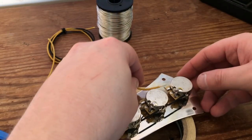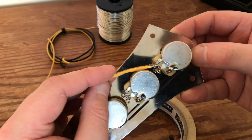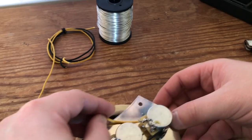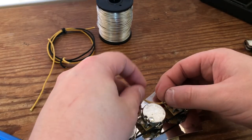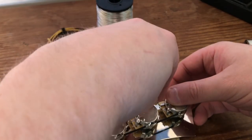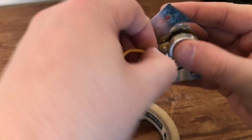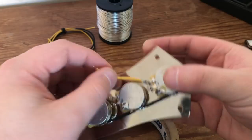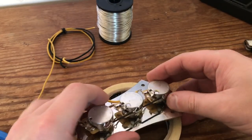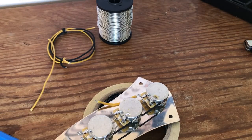So that's why you'll see a lot of people, and myself included, I do it from time to time anyway. They'll have the wire into the terminal like that, and then they'll solder it in place, which is fine. It's very good if you plan on making changes at a later date. But what you want to do is make the mechanical connection first. So that's wrapping the wire around, then soldering that in place. So I've wrapped the wires around the terminal and then I'm going to solder.